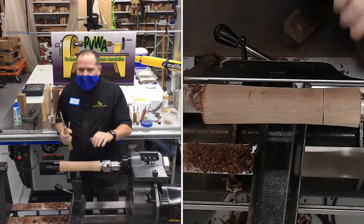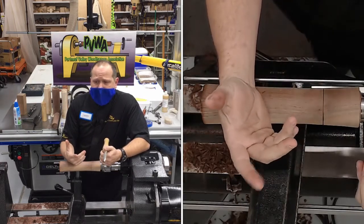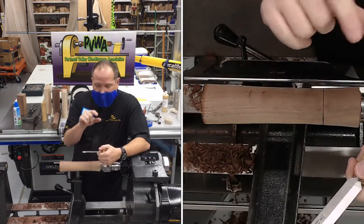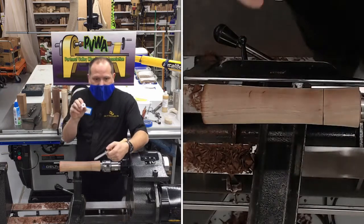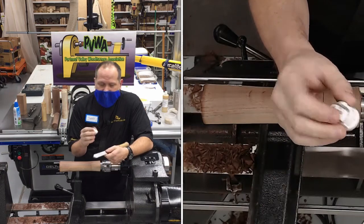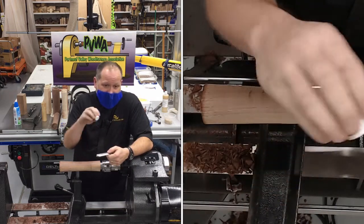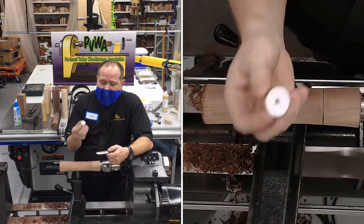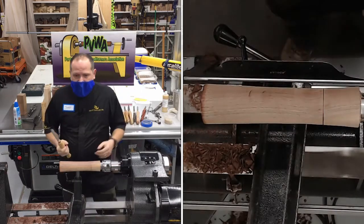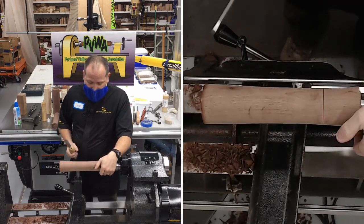Yeah, really hard. And in the crush grind mechanism, when you get it, the instructions call for a 1 1/16 bit to make a hole for this to fit in that would align, but we found you just got a little more wobble in that than I like. So I'm still going to use the 1 1/16 bit, but it's just going to create a hole to where this doesn't bind in there. Anyway, the tenon is something that I stumbled across on a YouTube video where somebody's making the same style that I've been making, and so I started to incorporate that.